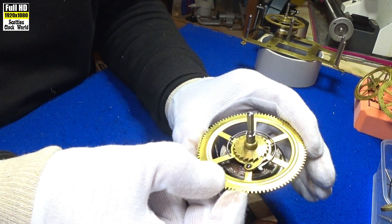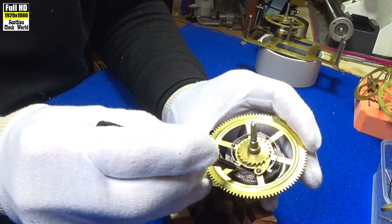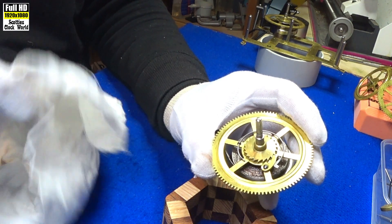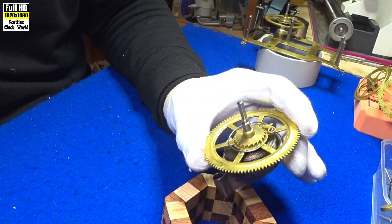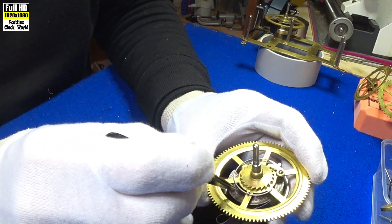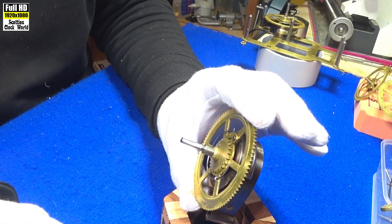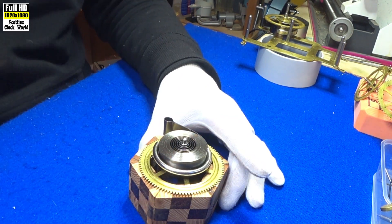That's about all there is about the great wheel. You can see that I've greased the spring — a little bit of grease there — that'll get wiped off before the movement is set in motion. The back's clean. We use grease, not liquid oil, on a clock mainspring because once you compress it and wind it up, it squeezes the oil out, which runs out and drops down into the case, making a mess on the bottom of the case. So that's the general rundown on the great wheel of a mechanical clock.